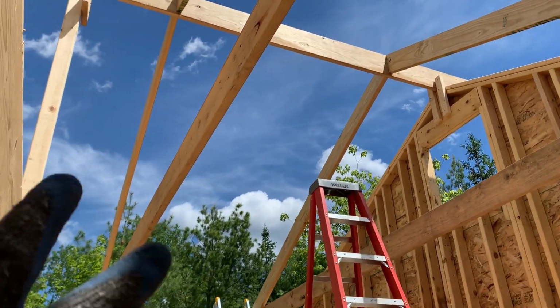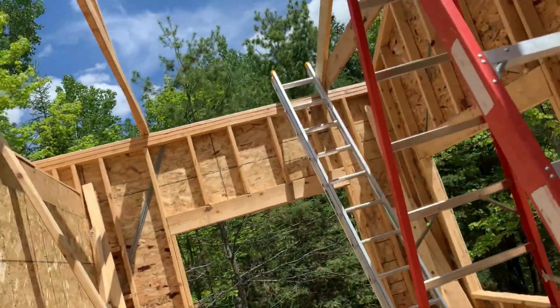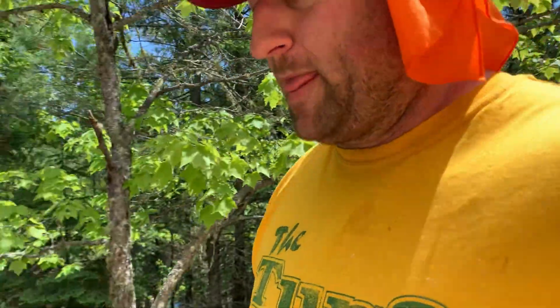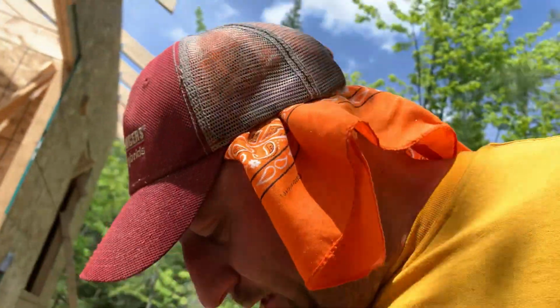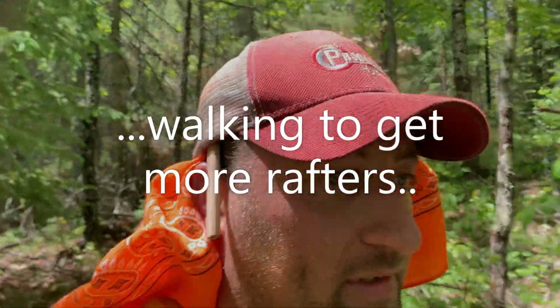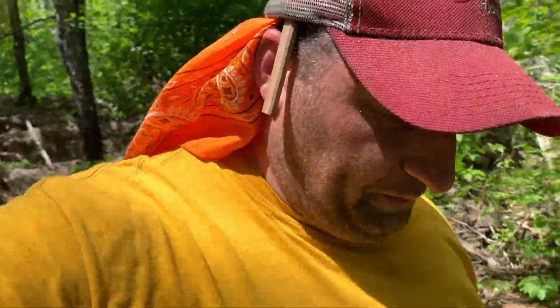1:20. I only got two sets of rafters up. I'm just having a hell of a time with these rafters. The cuts just don't want to fit. I feel like in every cut the slope changes. Sometimes it's 6, sometimes it's 5.5, sometimes it's 5 3/4, and that's very, very frustrating. I bet you I lifted one rafter to put it in place seven times, recut, recut. Oh nope, throw it away, get another one. But we got it. And I still have a few rafters to spare.